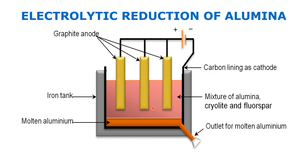When electric current is passed through this molten alumina, the aluminium metal is deposited. First, aluminium oxide breaks into aluminium and oxygen through electrolysis. Aluminium is a positive metal, so it will go to the cathode — the graphite lining. The aluminium deposits at the cathode and comes out through an outlet as liquid aluminium.